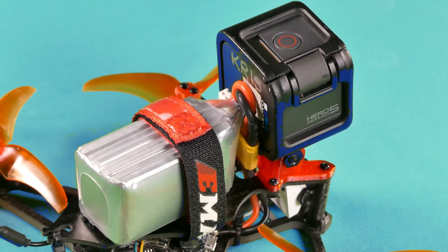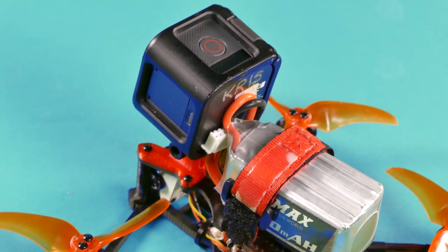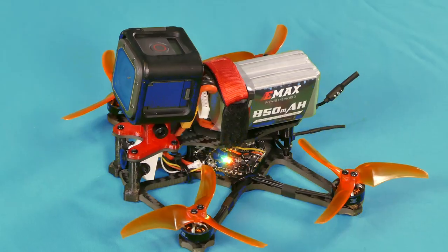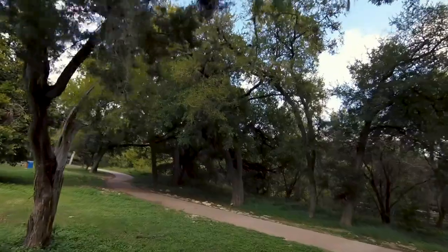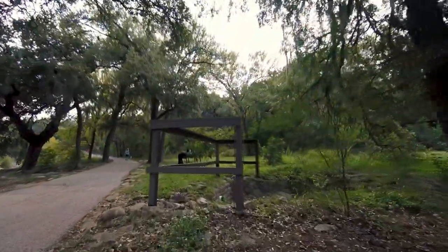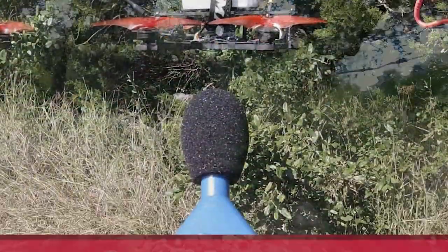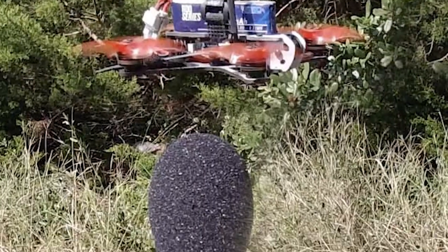When I have the GoPro attached and place the battery where the strap holds it securely, there is not much space to plug in the battery. I'm wondering if having the battery lead on the back of the Babyhawk 2 would have been a better option. It is nice to have the cutouts for the strap on the frame, however if I move the battery farther back to balance out the weight of the GoPro, the battery isn't as firmly situated. The Babyhawk 2 is fairly quiet — measuring at an average of 80 dBA on the A-weighted scale with slow response. For comparison, the Hawk Pro is around 87 dBA and the Tiny Hawk 2 Freestyle comes in at about 75 dBA.